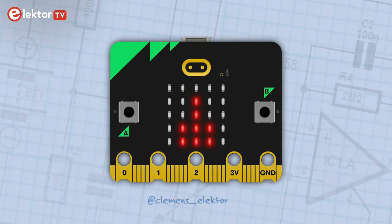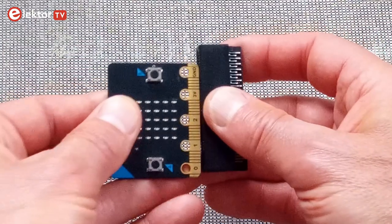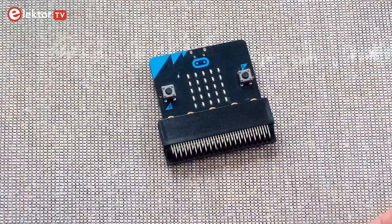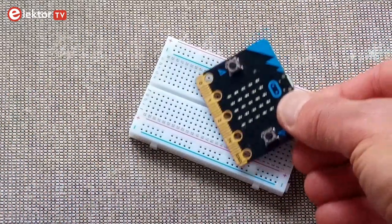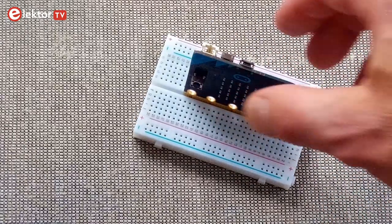The BBC Microbit has many strong points, but it also has a weak side, which is the extension connector. This is a PCB edge connector with contacts of different sizes and five large holes. The holes are intended for banana plugs and alligator clips or conductive thread. The edge connector only has 25 pins, and the contacts on the rear side of the board are all connected to ground. It mates with a double-row 80-pin female connector, which can be hard to find, is big and doesn't fit on a breadboard. Therefore, the Microbit is a bit difficult to integrate in a custom device or to use with a breadboard. You can solder wires to the edge connector, but then it won't fit in the socket anymore.